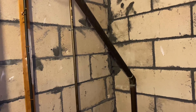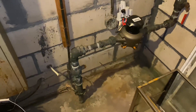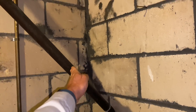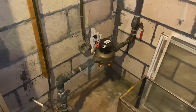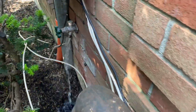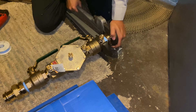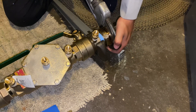Fortunately we have the press and we're going to bang this out. We'll probably cut here, maybe put a 45 there to keep it off the wall, then a 90 up there with another 45. We've got this big giant apartment building with 12 units — hose faucets open on both sides — we're going to drain down the building and make some cuts.